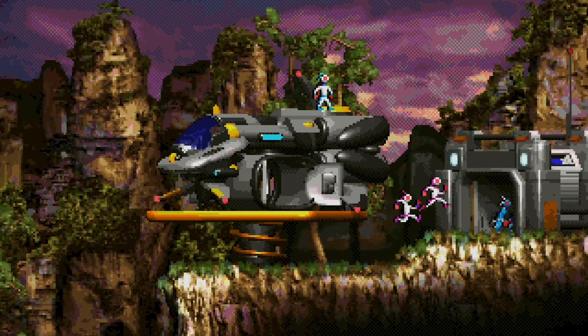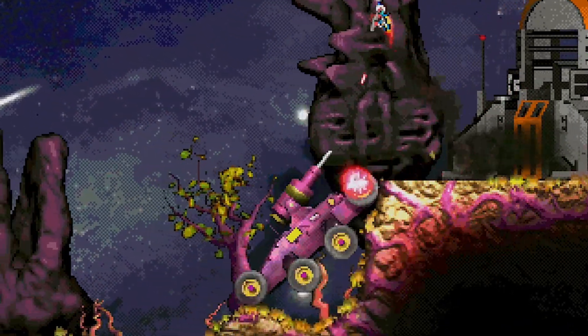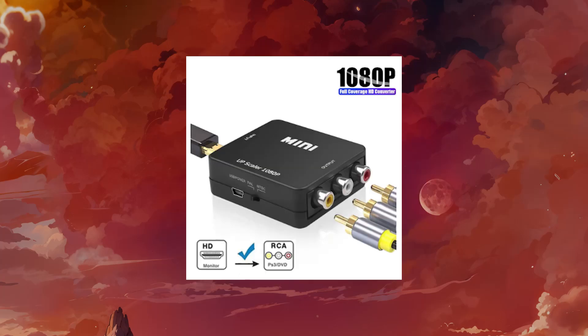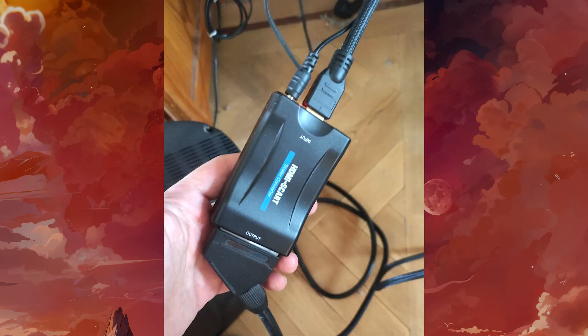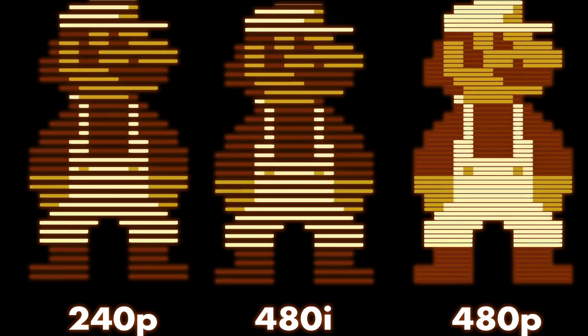It's about how I created a fake Commodore 64 that looks as authentic as possible to run Moons of Darsalon. So, is it even possible? Can you connect a modern PC to a CRT? Yes, there are options, but most of them are terrible. There are HDMI to VGA adapters, HDMI to S-video adapters, but they all have issues. Some introduce lag — I've tested a few that lag and even drop frames. Others downscale the signal, so you never know how the pixels will look. Or they output an interlaced signal, which flickers and isn't really what an 8-bit enthusiast wants.